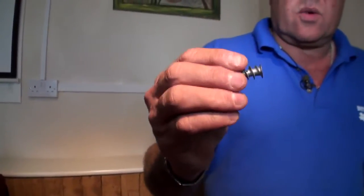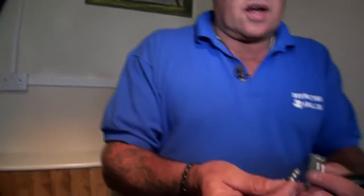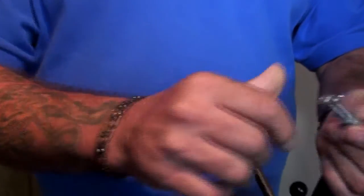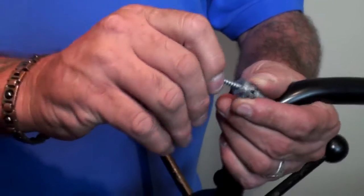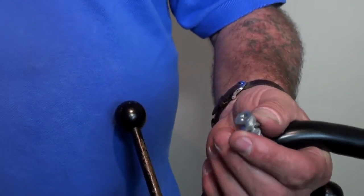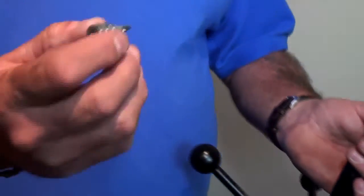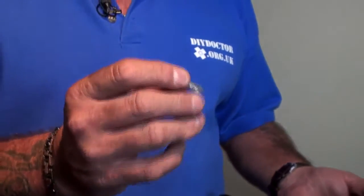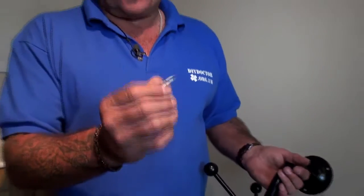There it is in all of its glory. And using that combined with the screws that come with it, it enables a very, very strong fix into plasterboard. We use these whenever we've got the chance. As far as we're concerned, these are the best fixings into plasterboard. They bite into the board and they can also be used in plasterboard that's got insulation at the back of it.